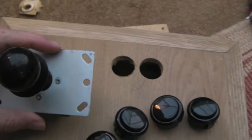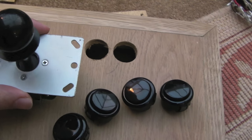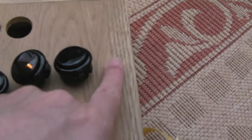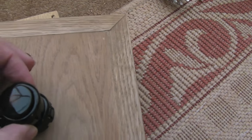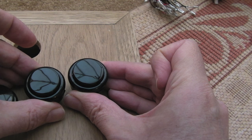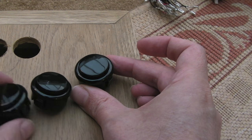The select and start buttons are done. Now I just need to do the main four buttons. Reviewing the layout: the stick here shouldn't interfere with the switches as long as the metal part isn't too close. I'm thinking the stick in that position, and then the buttons in a small arch. I need to make sure I don't get too near the edge because of the beading inside. I'll start with this button here and gradually work my way down, leaving about half a centimetre gap between buttons.